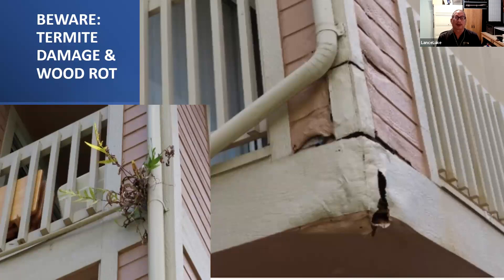It could have been repaired cheaper. I got called by a manager at a townhouse who said they had termite damage. I drove over and found the storage building connected to the townhouse was completely infested with ground termites. Also be aware: if you don't attend to wood damage on siding, it can cause mold and toxic mold, which is not good. You don't want those kinds of surprises.